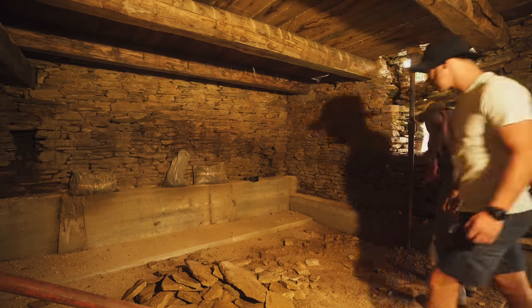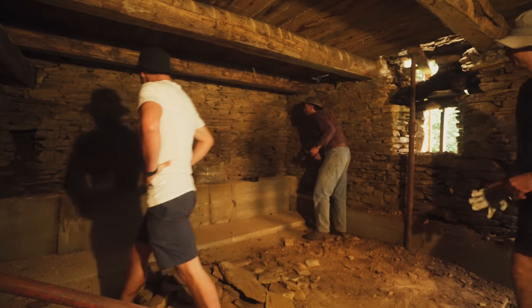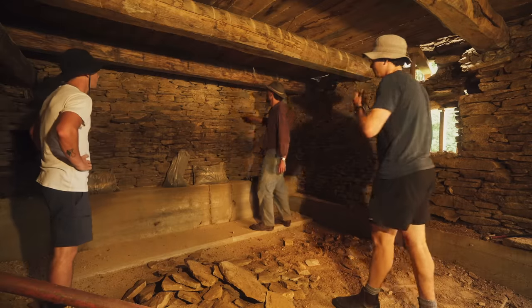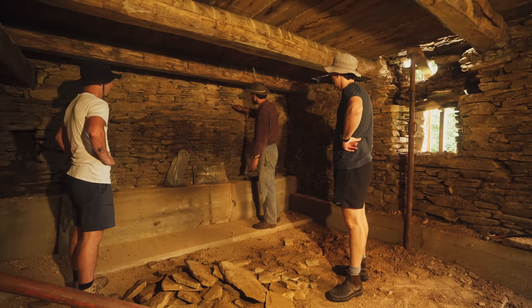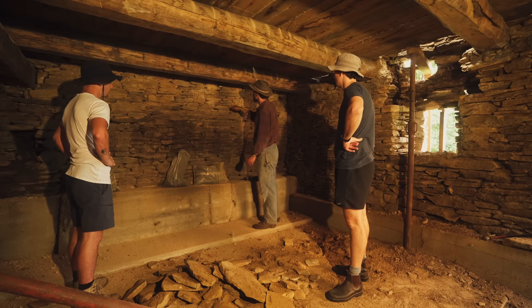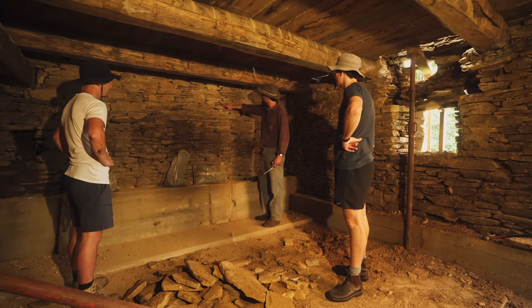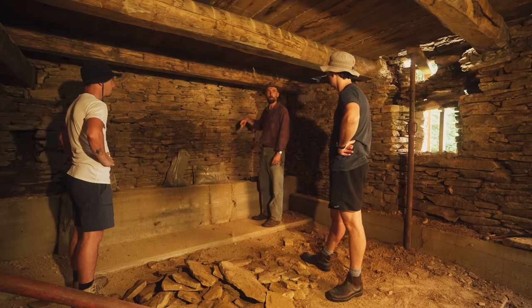Alright, let me show you. You'll have to find the best way for all this that needs to go out. Sometimes small stones come out, that's fine. I'll put something back. But I basically need space to put in new mortar, right? But this is a good gap. Yeah. You don't have to go super deep.